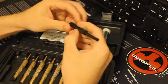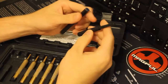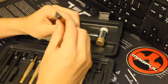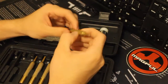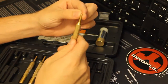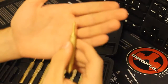Now we're going to get into the polymer punches. These are just multipurpose — you're not going to want to bang the crap out of these because they are going to break. These are just cheap polymer plastic. You've got a large 15/16 and a 3/8 here, and these are going to be good for large punches that don't require delicate work. Also, one thing to note is that on any punch set, really any tool that requires delicate work, it will start to mushroom out a little bit. You want to bench grind that mushroom down and keep these as flat and straight as possible, because otherwise you're going to get shoddy work and your punches are going to be malfunctioning.